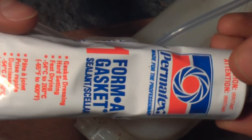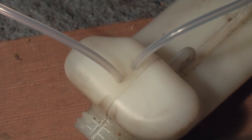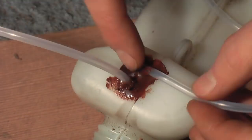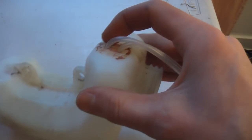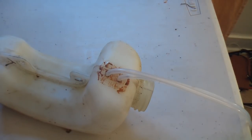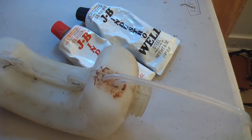The last thing I'm going to do is use this gasket creator stuff - it's sort of a gasoline-resistant adhesive, the closest thing I have to gasoline-resistant glue. I'm going to throw some of that on top here and see how it hardens up. Unfortunately, the gasket sealing just didn't really work - it's very crumbly once it dries. I knew it was gas resistant but was hoping it would be a little stronger, so I think the next thing I'm going to try is some good old JB Weld.